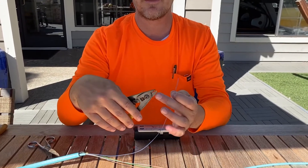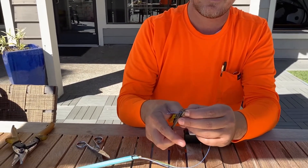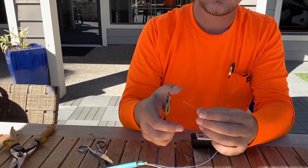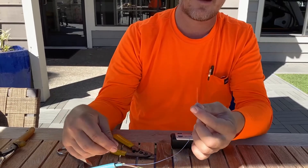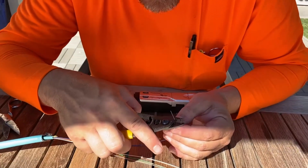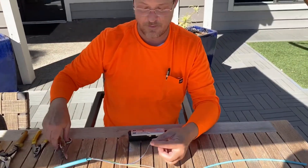We have some other cool tools in our kits from Amazon. This is the standard fiber stripping tool — two slots — main slot is down here. Usually you'd get a bite on it, and I try to pull from the back up. Sometimes it breaks — that's the problem. It's tough to get this off without breaking the inside fiber. So I get it about there, then pull it off, and we're down to our fiber. Then as another step, you have to line it up in this V-groove, line it up perfectly, and strip off the glue.